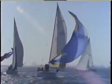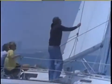Now we'll look at the elements of good spinnaker trim. If you're the sail trimmer, you're responsible for the whole sail, so be in a position to see the whole thing. Get aft when running, stand up in the shrouds when reaching. Call pole trim as well as handling the sheet. You'll need to be on good terms with the helmsman as well as the winch grinder, since the two of them can either make or break your job.